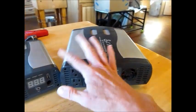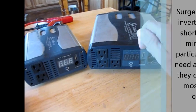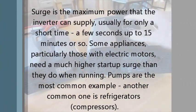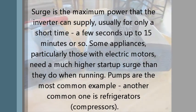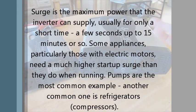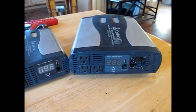When you are looking for inverters, I don't care what brand you go with — make sure you look for the peak. The peak is when you plug something in and start it. That inverter has to cover the surge to start your appliances, your radio, your TV, to turn the refrigerator on. So looking at a high peak is going to be very, very important.